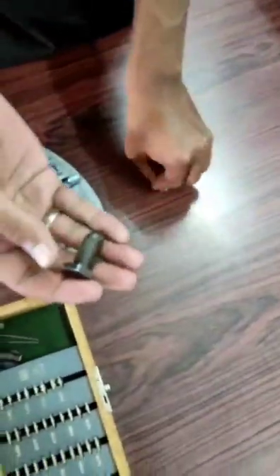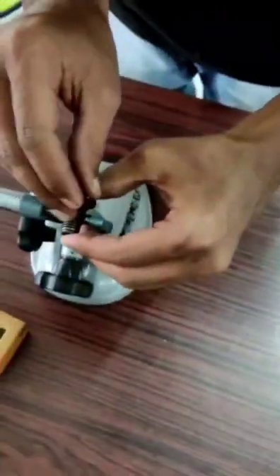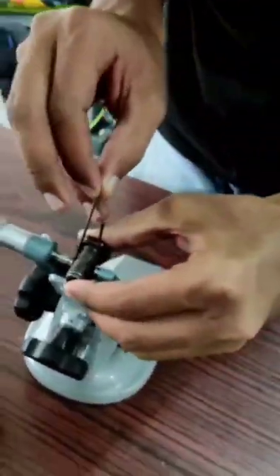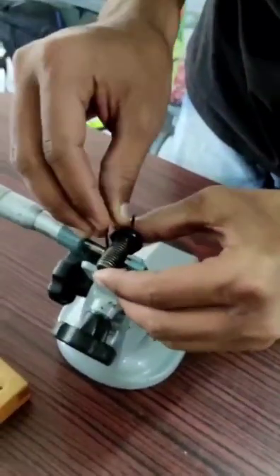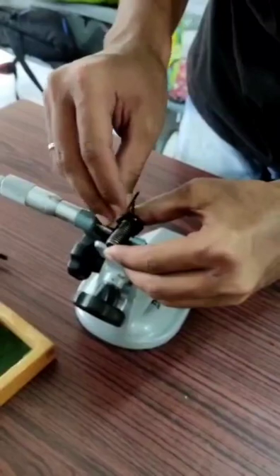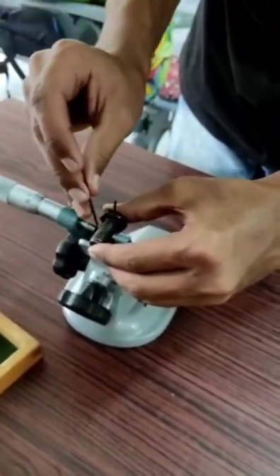This is the screw taken and these are the two wires of 1.65 mm. Now we will arrange the screw and the wires between the micrometer. We turn the micrometer screw in the anti-clockwise direction to loosen it, and the two wires of equal and precise diameter are placed in the thread grooves at opposite sides of the screw. Freedom of the wires must be ensured to adjust them under the micrometer pressure.